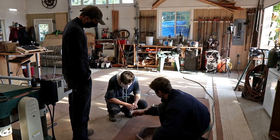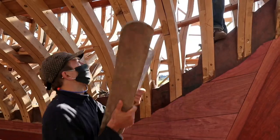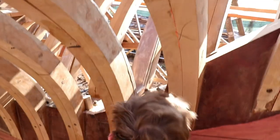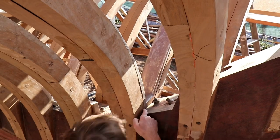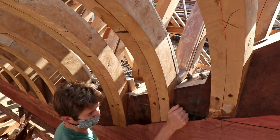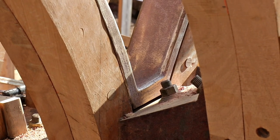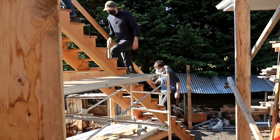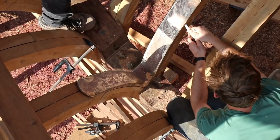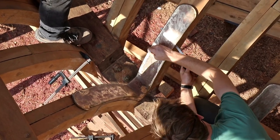This is part of the gate where the bronze flows in. Right. So these need to be taken down. And the idea is that you're trying to get the bottom to drop down so that it's sitting flat on this piece of wood. So you can see it needs to come down quite a lot right now. It looks like it's touching all the way up to there pretty much on this side.